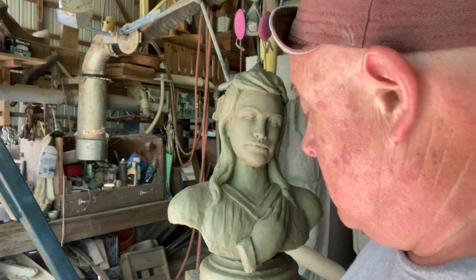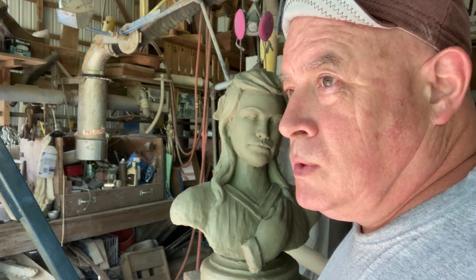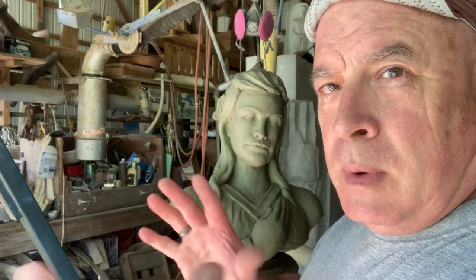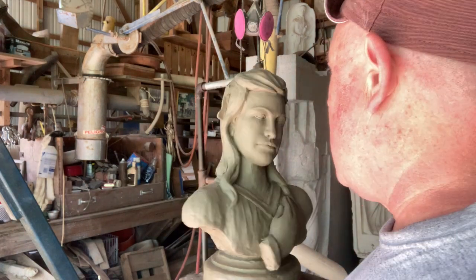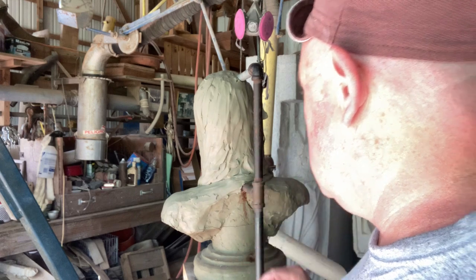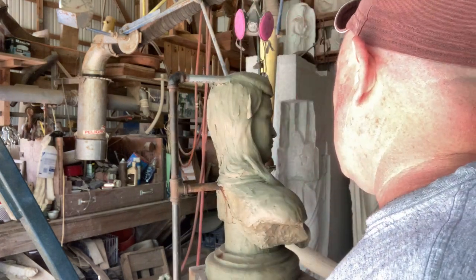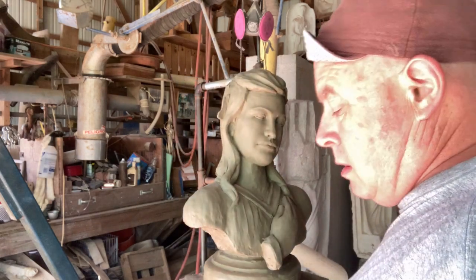I told you, you do these molds and it's what you're comfortable with and what you do all the time and what you do once in a while, and they go the way they go. Well, I'm going to try doing a mold that'll separate with at least a front, and probably take the back and split the back into two pieces and see if that will work. And so right now I'm trying to determine my parting line on the front.